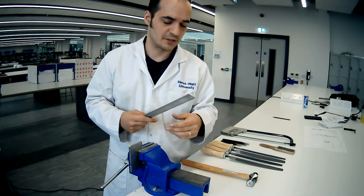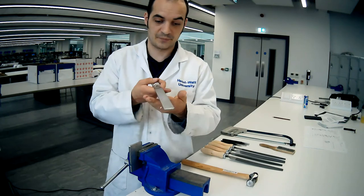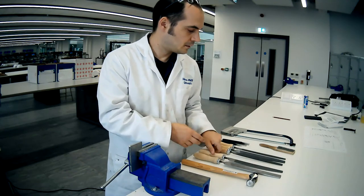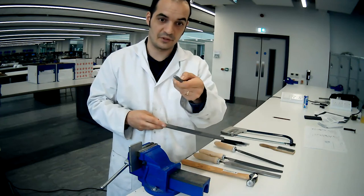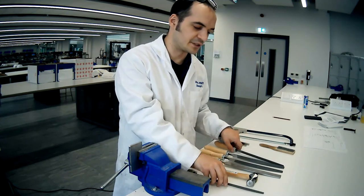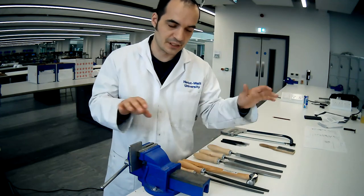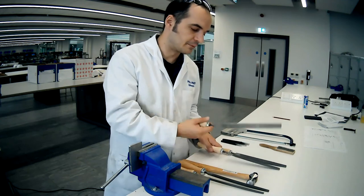Beyond that there's a dead smooth file as well. The latter removes tiny amounts of material but achieves a much finer finish. This particular one is a flat file - engineers like to name things very simply. This is half round, this is a square file, this is a triangular file, and a round file. So if you needed to open up a hole you'd use a round file; to square up a hole use a square file; to get into a corner use a square or triangular file. For large surface areas that's where your flat and half round come in - half round is also useful for larger radiuses.